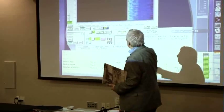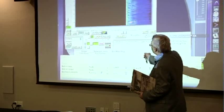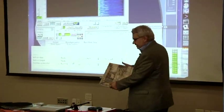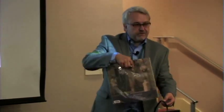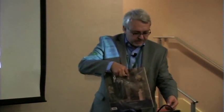It's 96 kilohertz right up here. 96. This is 10, 20, 30, 40, 50. And this is just some garbage that's picking up in the room somewhere here. This is not an ideal setup. The ideal setup for a moving coil cartridge would be to use a balanced, not like a conventional shielded, but a twisted pair with a shield. You get noise pickup immunity, common mode noise rejection, and lower noise. It's really the hot setup. But you can use these adapters as well with good results.